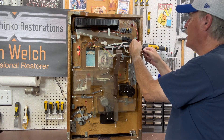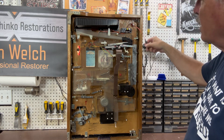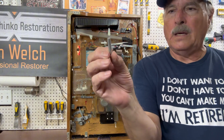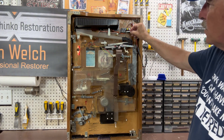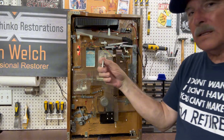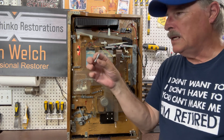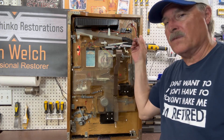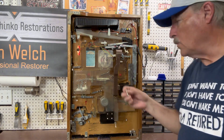When you get ready to load this machine, you can plug the little transformer in and plug it into the pigtail up here. Originally there was a piece of aluminum up in the fuse holder — I've seen this quite often. These little aluminum bars aren't going to hurt anything but it's much better to have a fuse in there. It's a two-amp fuse, so I've got that in there.